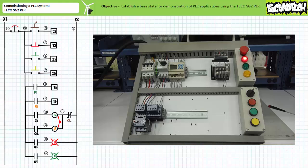When the overload relay is manually actuated into the open position, the F-contactor coil is directly de-energized without involvement of the PLC. Output Q1 may remain energized, but without the approval of the overload contact, there is no way the F-contactor coil will be energized. Input I5, the F1 auxiliary contact, is also de-energized, indicating that the F-contactor is open because of some outside disturbance.